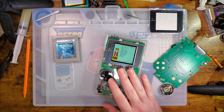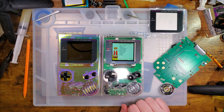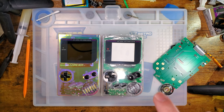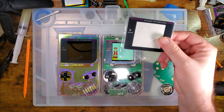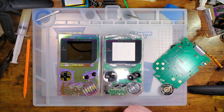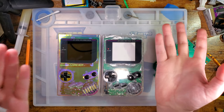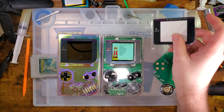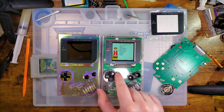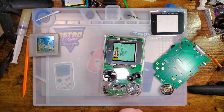This is a pretty decent kit. I think I might go with the 2.6 inch version over the 2.45, with one minor note: if you're using the lens that comes with the 2.45 kit, your screen will be centered, whereas with the 2.6 inch kit your screen is definitely not going to be centered, but it will be physically bigger. If you're getting custom lenses, the 2.45 inch version gives you a little bit more room in the bezels for designs or whatever you want to do. But either way, they're both solid kits — I don't think you can go wrong with one of these in the DMG.